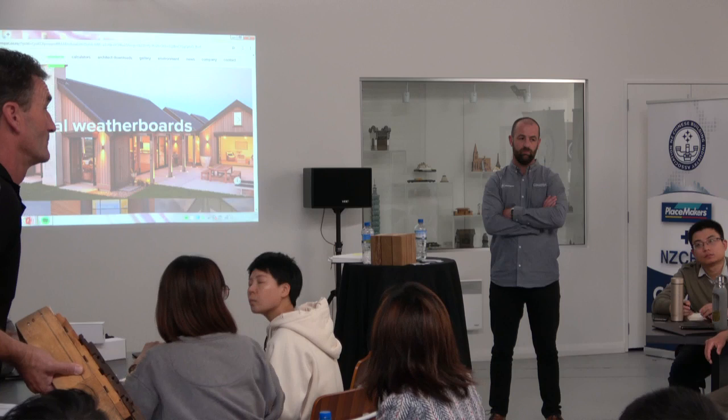Again, when you've got cut ends, or at the bottom of any boards, if you've got your stain or your oil, put plenty on there, because that's what's protecting the boards. That's the worst part. It's all extra.